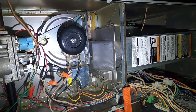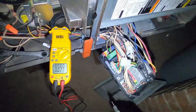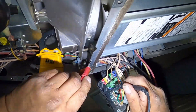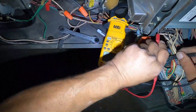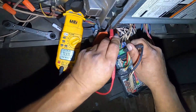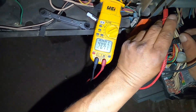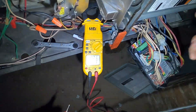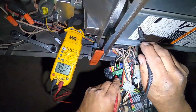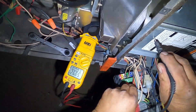You can do the reverse troubleshooting by checking your 24 volts from the thermostat. Place any lead on the ground of the furnace, then on the red — which is your 24 volts going up to the thermostat — check and put it on the W, which is your heating circuit. If you have 24 volts there, then you do have power coming down. If you don't have 24 volts on the R, you might have a power issue, so we'll have to go backwards.